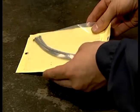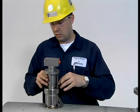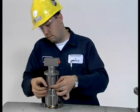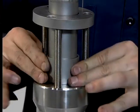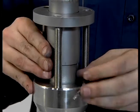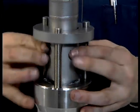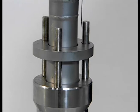Carefully insert the three packing rings provided in the manila envelope. They should be installed one at a time between the welded lock ring and the packing follower. To avoid potential leak paths, do not overlap the gaps in the packing. Start a piece of packing at each stud. Use the follower to compress the rings into the slot. Once the packing is in place, push the packing follower down into the pack lock body, forcing the packing against the welded lock ring.